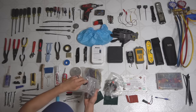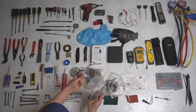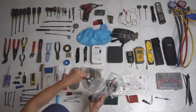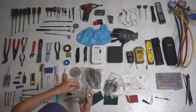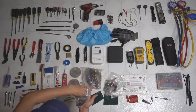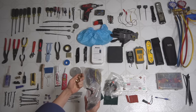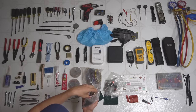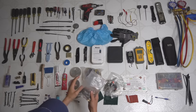Then there are hoses for teeing into gas valves and furnaces mostly with a manometer to check gas pressures — mostly to line it up in series. Then there are some plugs, some anchors, and this is just plugs for pipes and caps, and a few other miscellaneous things in this bag.